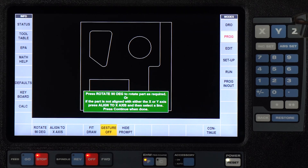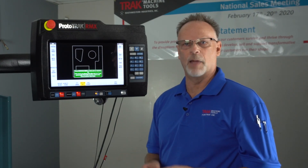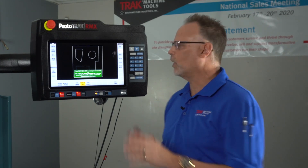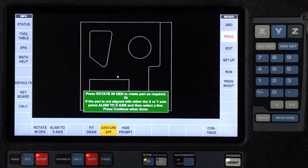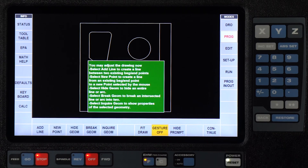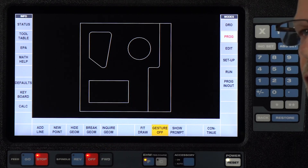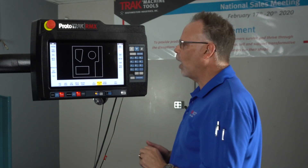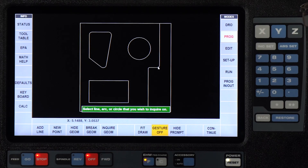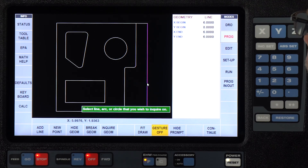Before I move any farther, I want to explain something. Because I'm working on the machine with the touch screen, I don't need a mouse. But if I was doing this in my offline programming where I don't have a touch screen, I can use a mouse. In this particular case I'm going to use the mouse for some of this because it'll help keep my fingers out of the way. I'm going to push continue and use this lower left hand corner for zero. Now it's a little bit easier to stay out of the way if I use the mouse. I don't need to add any lines or hide any parts of this. What I actually got here is that this part here is going to be standing as well as those three profiles — so we can do closed profiles as well as open profiles. I want to click on this button that says Inquire Geometry. I need to know the size of that inside radius so I know what size tool I can fit in there. I also need to know the overall size of the block — and this block is also six by six.